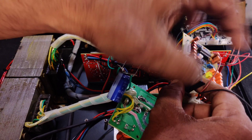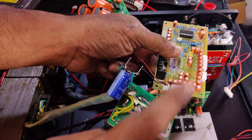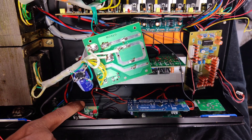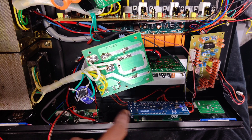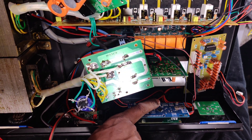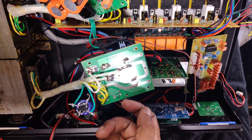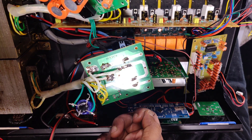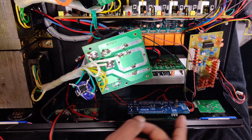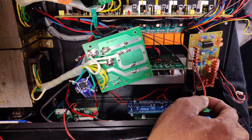The connection is over, and the 12 volt should be connected to the power supply. From the front panel there are certain connections coming here. You can see the USB Bluetooth panel — it can also be controlled using the remote kit. The connections are connected to this point where the IR and power supply will be switched when we select the USB function on the remote control. Then only the 5 volt will come to the USB Bluetooth panel, and the output from the USB panel will be connected to the control board.